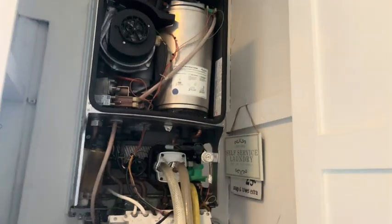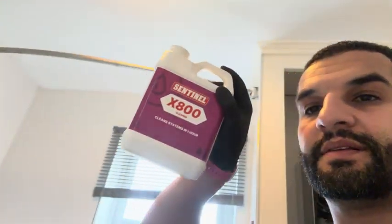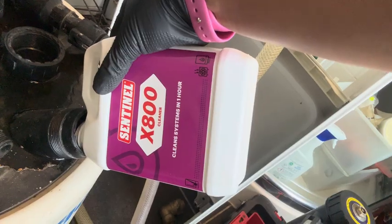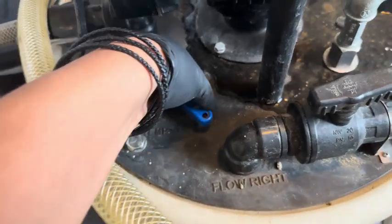You can probably hear the flush is running. I've been flushing, it's all going well - I've done my first dump and now I'm putting in some x800 chemical. Let that circulate around the system for around an hour - I find that quite a good chemical. Then we'll start agitating to try and loosen up some of the muck in the system ready for the new boiler going in.